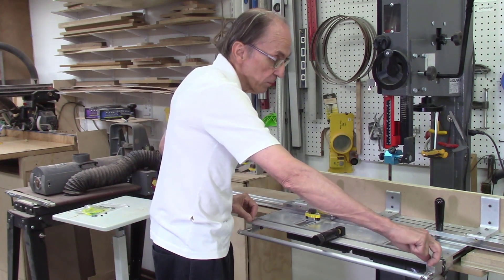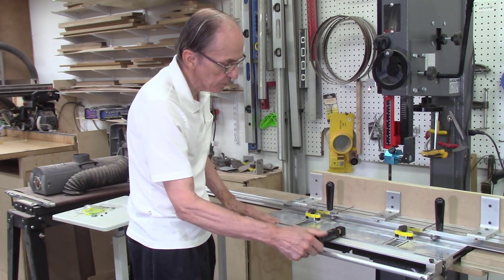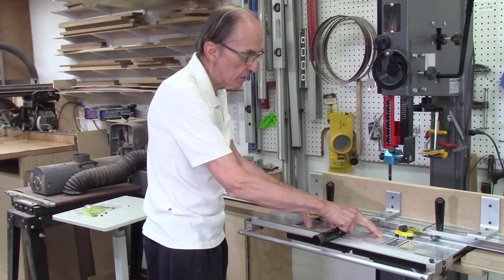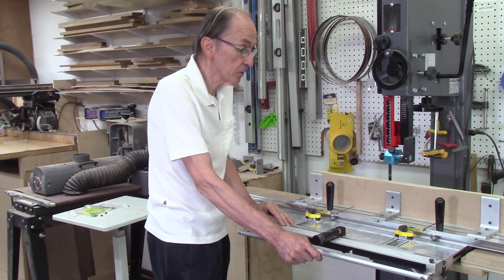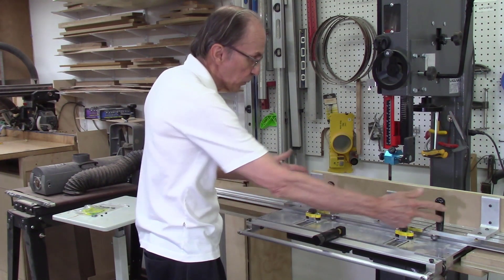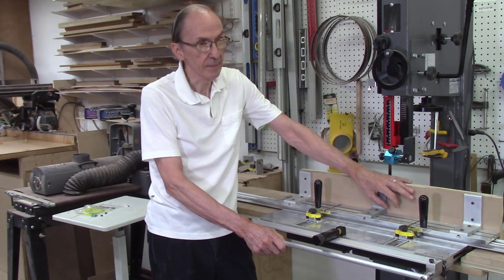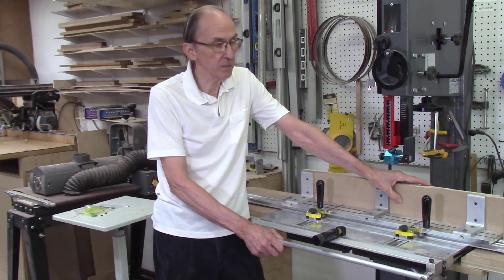Using this system, you normally mount your front bar as your anchor point and screw the system in to give you different thicknesses of boards. If you can reduce that friction on this front plate, will it give you better accuracy? Normally when cutting boards about two inches thick, I get an accuracy of plus or minus one or two thousandths of an inch.